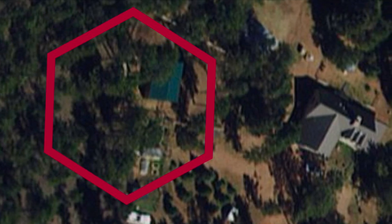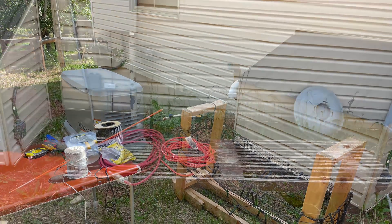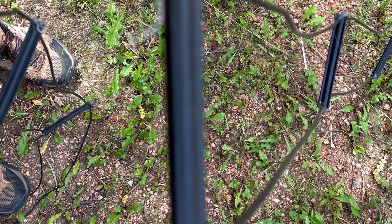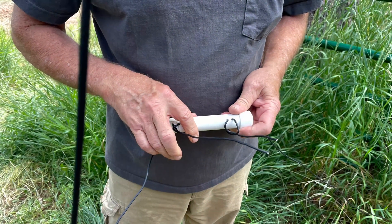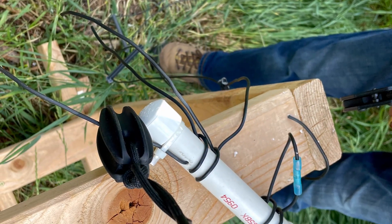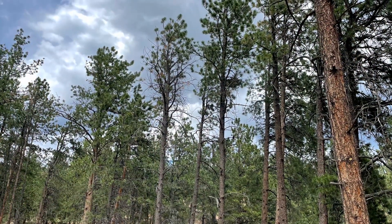The theory is that we want the shape of the antenna to be somewhat like this — there's going to be six attachment points. We're using the electric wire, the paracord, and zip ties. He had already pre-made his ladder line. There's a ladder line with isolators, two wires — they're 100 feet long each leg with separators. The strain relief is going to go through that PVC piece. The 300-foot wire will attach on one side, with the ladder line connected to that, all zip-tied and connections made and taped over.